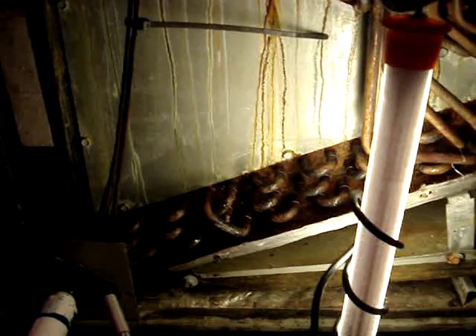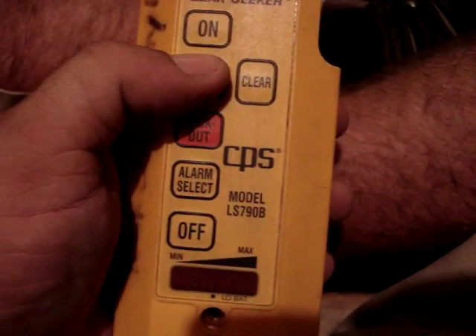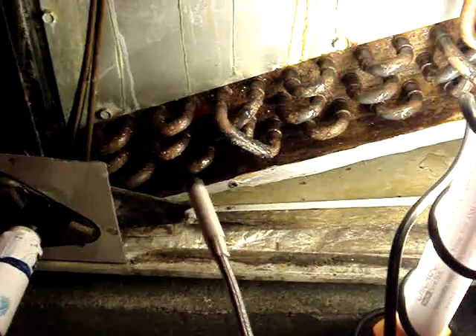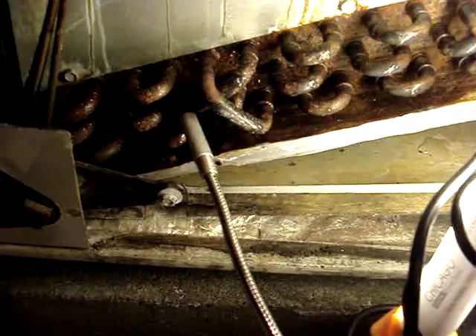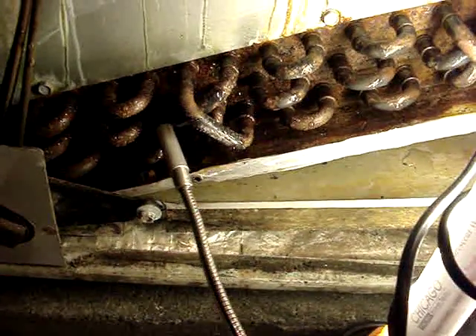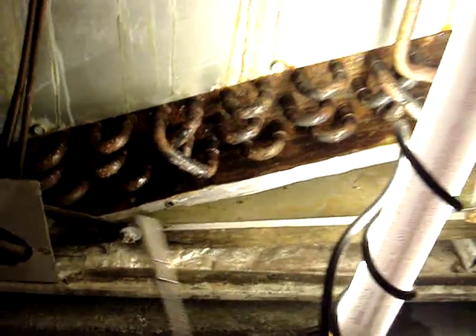Here's our coil at St. John's looking to find a leak. This is our CPS leak detector that I use. Turn it on, turn the sensitivity up right there. We're looking for a coil leak right down in this area — there's our coil leak.